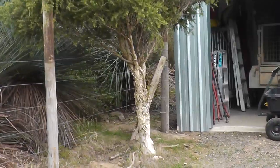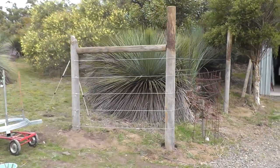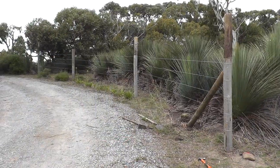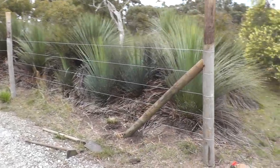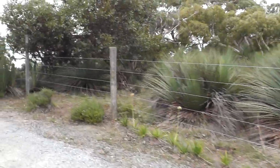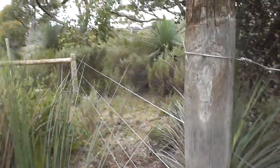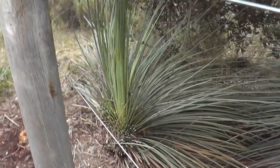I've braced that one so it can pull against those wires back to that post — kind of a box strut. That rail does look like it's crooked but it's perfectly level; the ground just goes uphill there. That one's braced and it goes up to five wires high here, but four wires after that because it goes to a shorter boundary post. Those wires are all nice and taut.